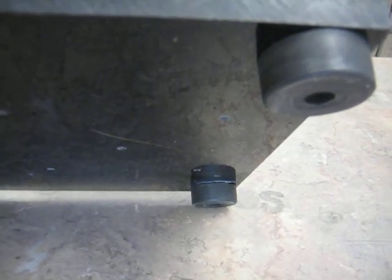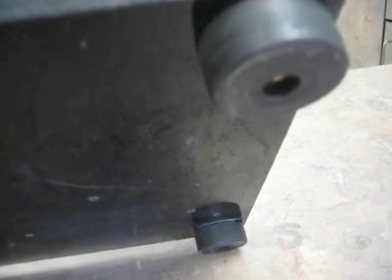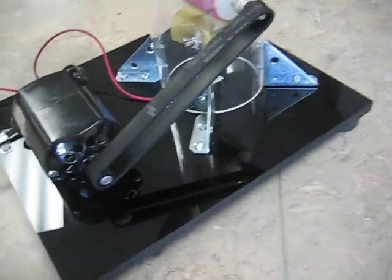At the very bottom of the generator, you're going to see rubber feet. I connected these using Gorilla Super Glue — that's definitely the best super glue on the market. You're going to see machine screw holes on the bottom, and you can take out the little copper inserts and insert the 5/8 machine screws into them. The screws will self-tap into the hole — it's going to be a tight fit, so just make sure you don't over-tighten them, otherwise it will strip the hole.